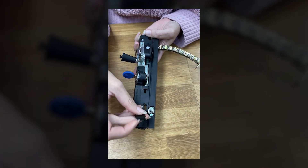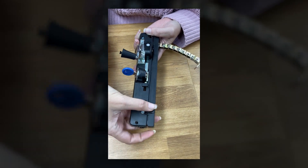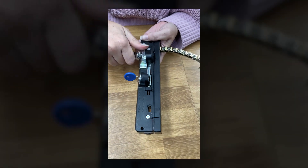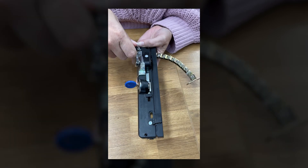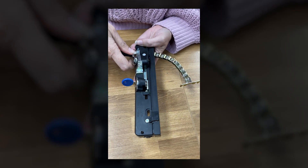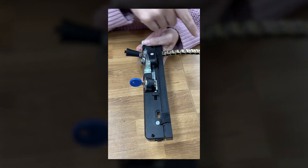Refit the cover cap. It will no longer wind past the 125 mm, making it a restricted chain winder. Remember, from the back of the chain winder to the inside front of the window sash can be no more than 125 millimeters or 12.5 centimeters to ensure you meet the legislation.